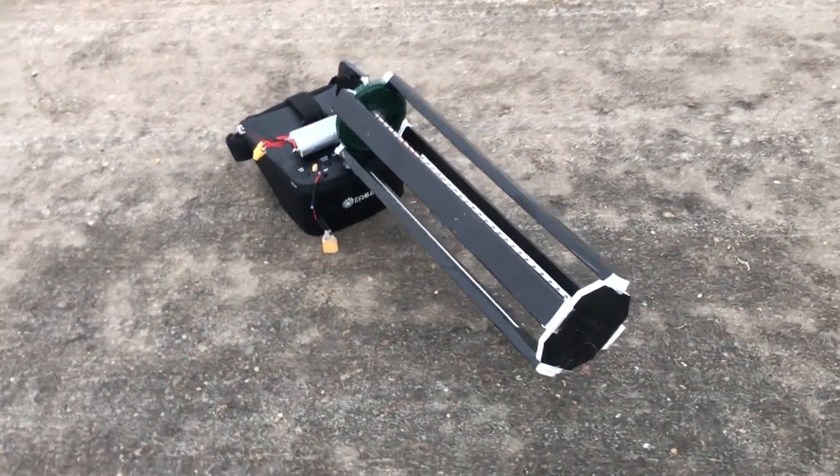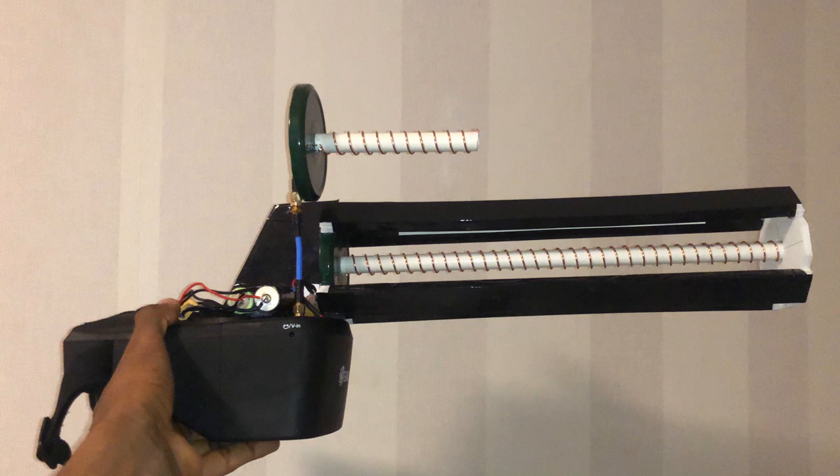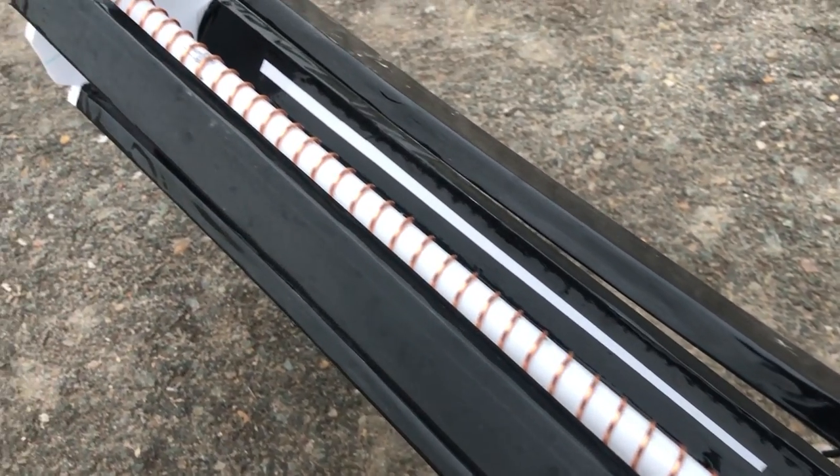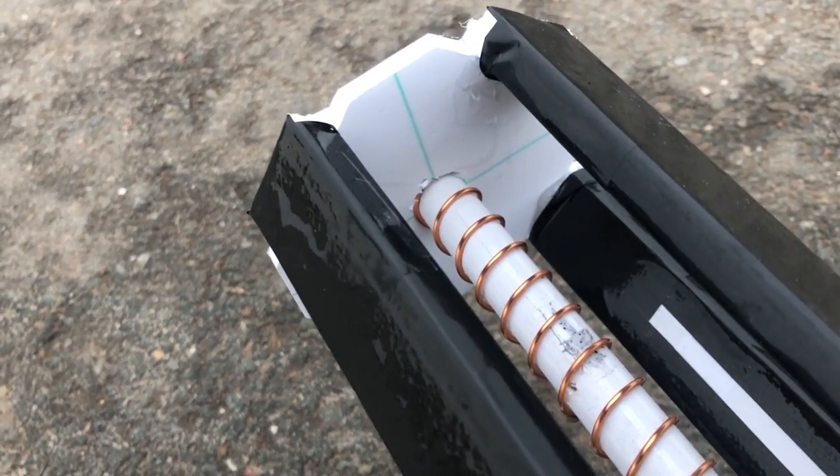In this video I'm going to test and compare my crazy homemade FPV antenna. It's a 34-turn 5.8 GHz helical antenna made with thick copper wire, a 15mm ABS square tube, the lid of a pickle jar, and the remnant of an FPV antenna and foam board as the supports.